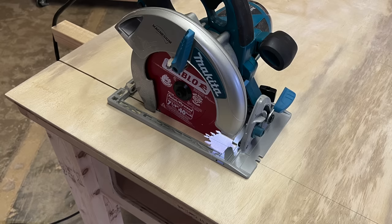Don't back the saw up too much in the middle of a cut — people do this all the time. They start to get a little off course, then pull the saw back like an inch. This creates two big problems: you'll have a big notch at the front, and when you pulled it back so far you also created an opposite notch at the back end. Remember the blade is a long straight line and it can cut at the front and at the back. Too much of this just makes a horrible line — it looks like barbed wire, with double bad cut marks and tons of blowout. Instead, just take it slow and only make tiny adjustments to keep the front of the blade on track.